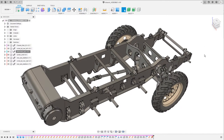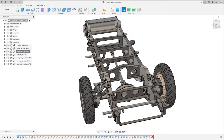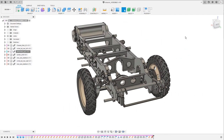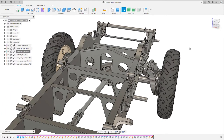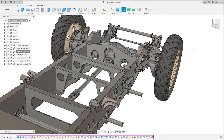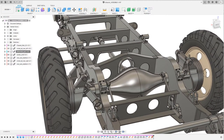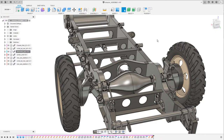This is what the new design looks like. You are already familiar with the chassis from the last video, and as you can see I have removed all parts of the tracks for the moment so that I can focus solely on the rear axle. This one can be lifted and lowered. The Sauer RK7 was able to drive on its wheels and on the tracks, and to drive on the tracks it is necessary to lift up the front and back wheels. For the rear axles it's quite difficult because they are connected by a differential gear in between, and this gear has to be hidden inside the base frame when you lift the wheels. This was possible by a combination of a few links with different joints in Fusion 360.